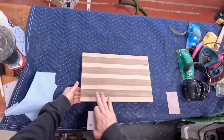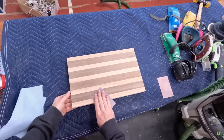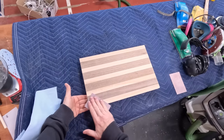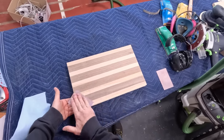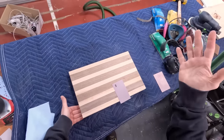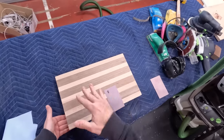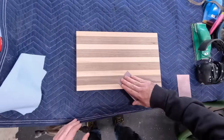I'm not going to use my power sander for this — just a light touch by hand to knock that grain down and smooth it out again. If you sand too aggressively and go back to power sanding, you're just going to go right through that top layer which has already been pre-raised, and then it's just susceptible to raising again. So by hand, that's the way to go. I am going with 220 on this.